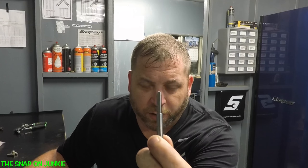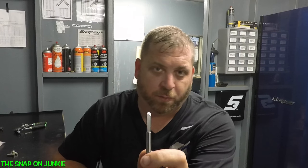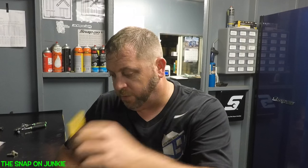The next thing I bought from McMaster Carr is carbide drill bits. Now here's the problem with these - these are made for removing taps, but the problem is you can't use them with a handheld drill. You can't get enough down pressure. This is only for use in a drill press or a milling machine where you can get a ton of down pressure to push this through. But we do have some carbide drill bits and I will show you that they will drill a little bit, but it doesn't work out very well.